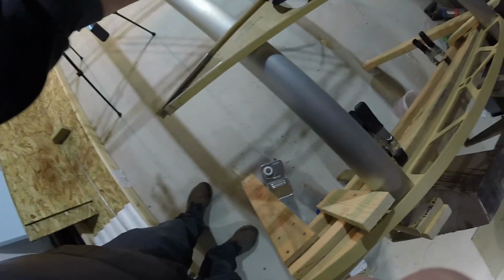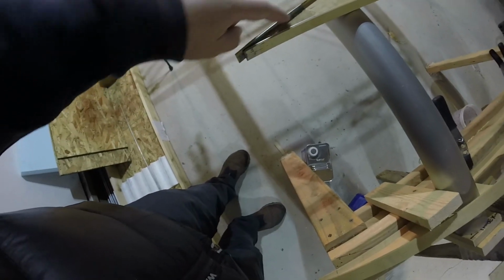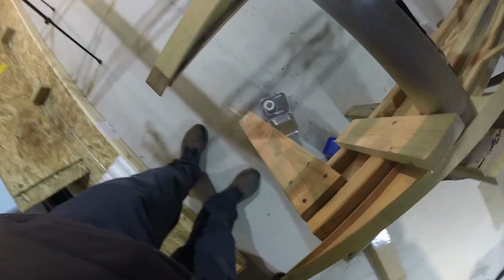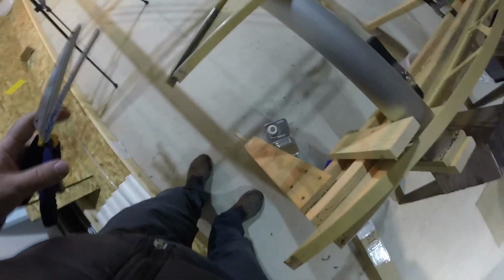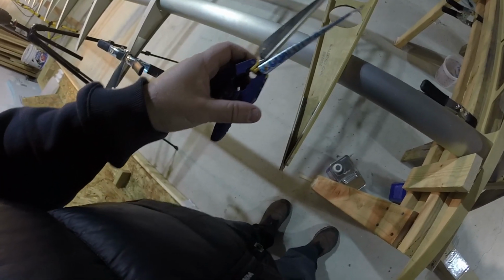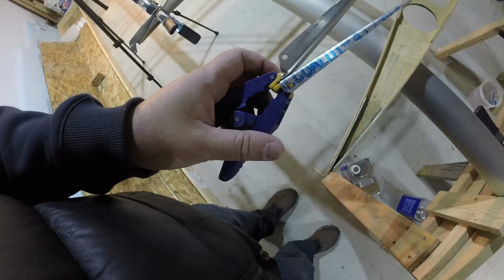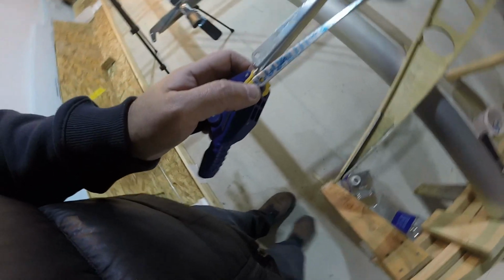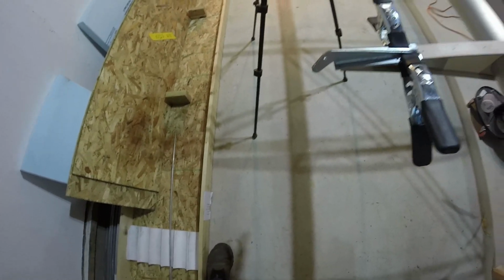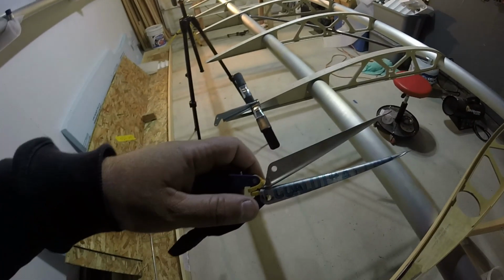And again, these ribs were different. This is the one that's intended for hinge brackets. You bond these aluminum doublers in here on both sides. This side's a little easier to see them. And then the brackets, I have 2 of them. There's upper, lower. They're clamped into position. And you're supposed to rivet them at the base. Well, you can see already this hole pattern, which was so easy on the new style Series 7, to mate up with that. A little more difficult here.